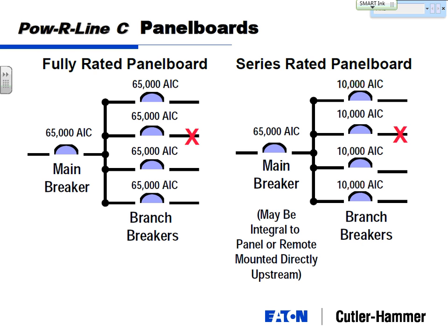Now this circuit breaker here, the same size, form, fit, function is available in 35,000 amps AIC, 65K AIC, or 100K AIC. Same exact breaker. So if I'm laying out a panel board, and I've got three of these breakers, which one do you suppose is going to be the most expensive? The 100K, and then the 65K, and the most cost-effective, the 35K.